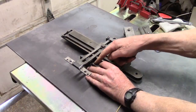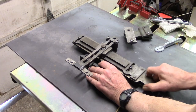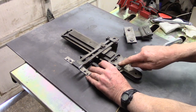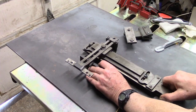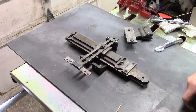With this point and this point fixed, this moves on the dovetail and translates the slide offset that is set up on the degree scale - it transfers that to the cross slide. So throughout the whole range of movement, the cross slide is just slightly moving. I hope that gives some idea of how it works.